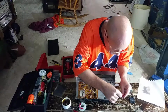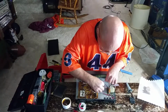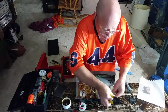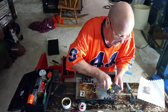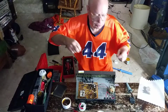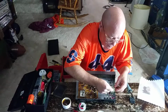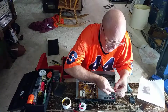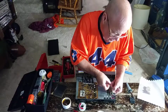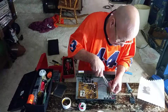Now this wire, I'll bring it down underneath here. And I will come up to our block about right here. Strip it. I'm going to twist our strands together here. Put it in the hole. I'll make sure no strands are sticking out anywhere. I'll bring this back a little bit. I'll use the pliers, bring the strands down on the front, and then just kind of curve the back up there a little bit.